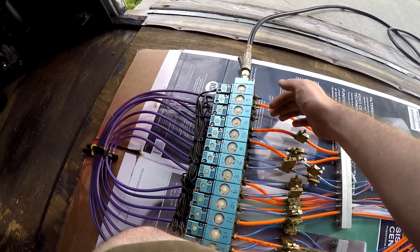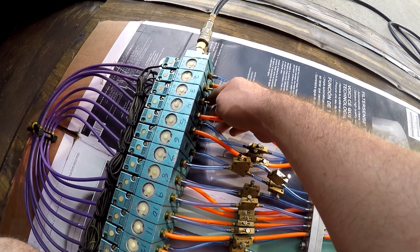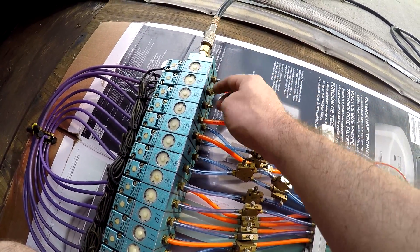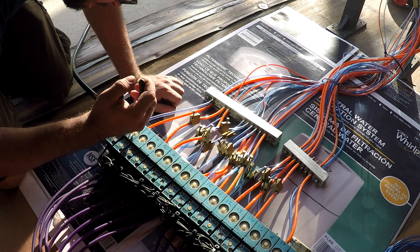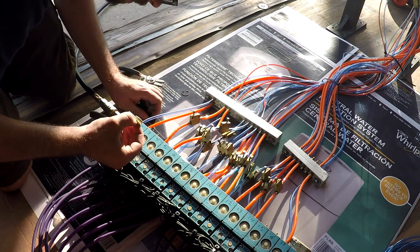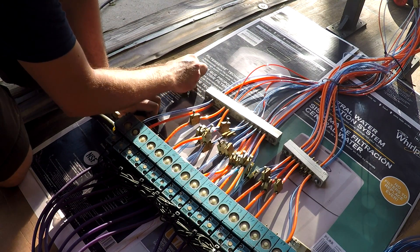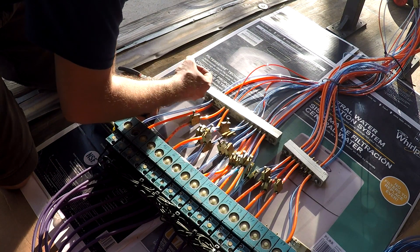This valve's not being used. Port B is being plugged up. When the valve de-energizes, port B should have pressure in it and there shouldn't be anything on port A. But this valve's messed up so I'll open it back up. That cap seems like it's fine. There's the plug — I think I see what I did.